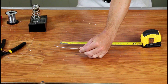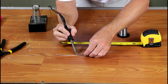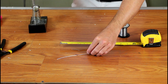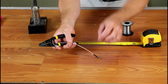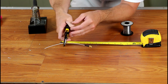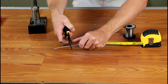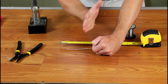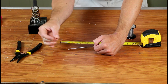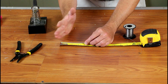Now to take off the shield, a little solder goes a long way. Once you get down to that point, go ahead and at the base, tin up your shield. You don't want to go super heavy here. Then at the end of your solder joint, take your cable strippers and progressively work your way up until you feel it bite in. Then break that new solder joint clean, just moving it around. Back up one notch on your cable stripper and it slides off nice and easy. I recommend doing this in two stages, about an inch and a half to two inches at a time, because this provides a lot of friction and can be hard to pull off. I ended up with three and a half inches, so that's plenty. To tune it, I'm going to cut the end off.